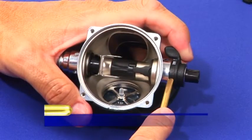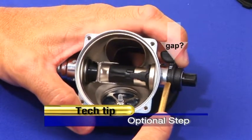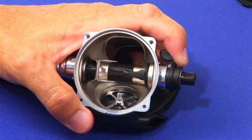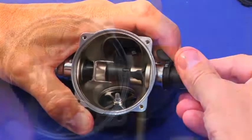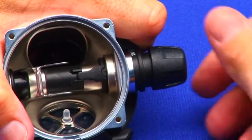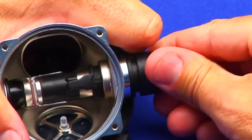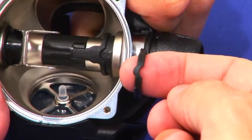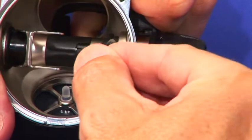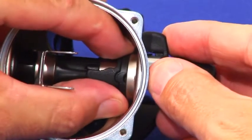Here is an optional step only to be used if needed. If a gap is present between the dive switch and case, hold pressure with your index finger. While holding pressure, engage the adjustment knob and turn counter-clockwise — the gap will close. The C-clip retainer land is now accessible. Orient the retainer clip wave-top inward and snap into place. Press the clip top and bottom to be sure the new clip is correctly engaged.